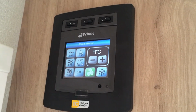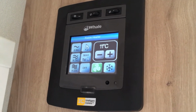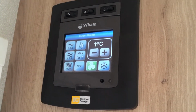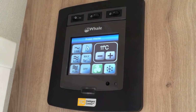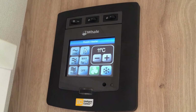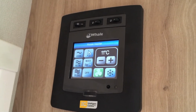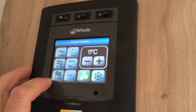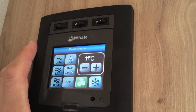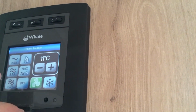Now, it is very simple to do. So, say you've got a 2 kilowatt fire. To work out the amps on that, it's 2000 divided by 240 volts, which gives you 8 amps. So, if you're on a campsite and you've got a 13 amp supply and you put a 2 kilowatt fire on, you're only using 8 amps. It still gives you, you know, a healthy 5 amp. So you're all right. Now with this heating system, if you're on a 6 amp site, you can put it on 2.9 and it still gives you 3.1 amps. So that's great. Okay, now we'll scroll back.